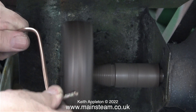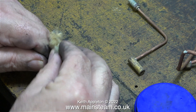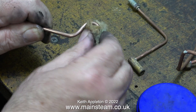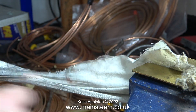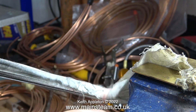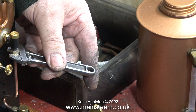These parts get hot when you do this — so why aren't I wearing gloves? Well, I have a thing about gloves; I don't want to wear them in the workshop. Next to the polishing spindle I have a pot of water, and periodically I drop the parts in to cool them down. This is the connection from the hand pump to the check valve, and as you can see I'm using Brasso wadding. The polishing spindle wouldn't allow me to clean inside the loop, so I do it this way — just a piece of cotton cloth clamped in the vice. I started the job off using Brasso wadding and I'm finishing it like this. This clip shows me fitting the part to the boiler and the water pump, and as you can see the inside of the loop at the bottom is quite shiny.